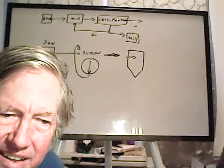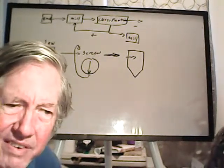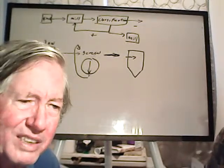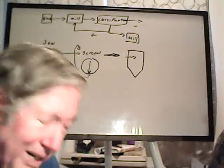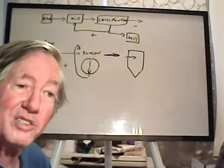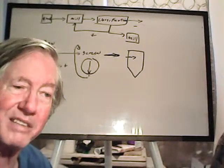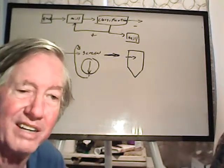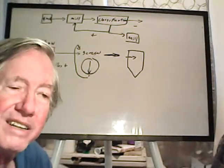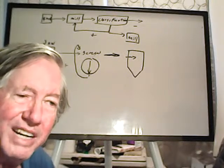Yeah, John, that's how it works. Yeah, Kaowool as a ceramic blanket works fine. I'm looking more for the ceramic foam like that. Another thing, does anyone know just a ceramic plate, the equivalent of like a 1/4-inch thick ceramic tile, but no glazing on either side? So you cut a 6-inch square piece and put it in the bottom of that kiln to catch spills and such. That would be very handy to have.